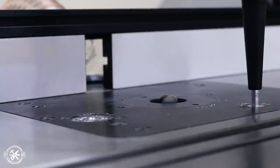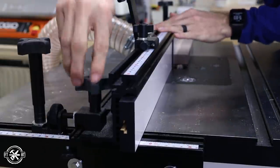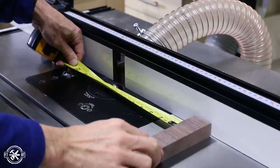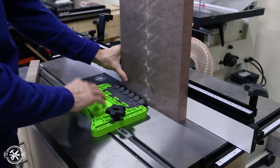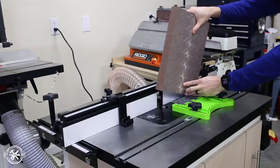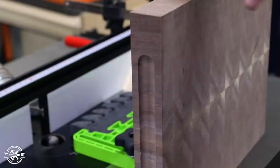I'm using a 3/4 inch flat bottom bowl bit raised about a quarter of an inch above the table. I used one of those extra strips of the slab board for the setup, then moved the fence until it was centered right on the edge of that strip. To set the distance of the handhold I marked two inches in from each end of the setup strip, lined up the mark on the outside of the bit, and set the fence flip stop to define one end. For the other end I transferred a mark onto the fence for the second stop block. I set up a feather board to keep the board tight against the fence, and clamped a scrap with a 45-degree miter at the starting point. To make the cut I register the corner of the board against that miter block, pivot it down onto the bit, run it across until I hit the other stop block, and pull the board away — a safe way to get a nice handhold routed on each end.